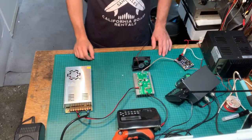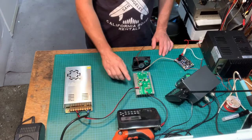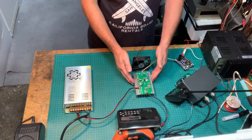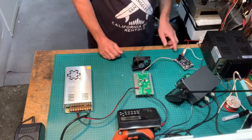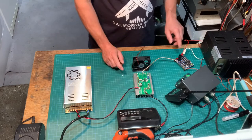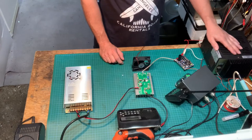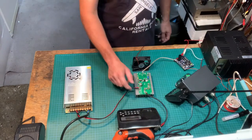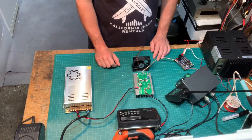Right, okay, so it's all set up on the bench now. We've got our power supply putting 48 volts into our amplifier and we've got our cooling fan there, because I found this does get rather warm — especially that end there. Our transmitter here is putting our 1 watt into our amp. The transmitter is being driven on this power supply here which is 12 volts, and of course we've got a power meter, a frequency counter, and also a radio to test the audio a bit later on. Let's get it powered up and see what it's like.